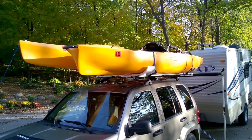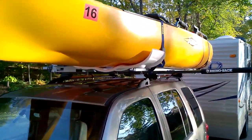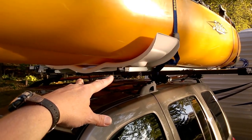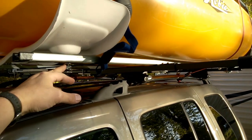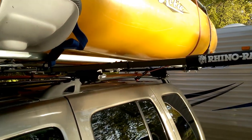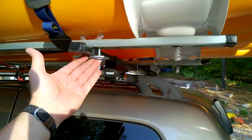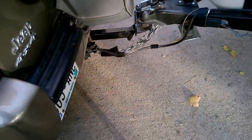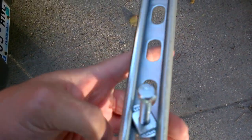I'll do a couple more little snippets so you can get a feel for what I've got going here, especially this home-built rack setup with the Pro Angler cradle and these channels I picked up over at Home Depot. It uses spring nuts that go up on the inside — it's a 3/8-16 — and I just use a fender washer and a split washer in both places. Here's what that channel looks like; the manufacturer is Super Strut B1400 HS.